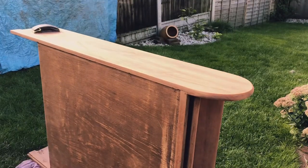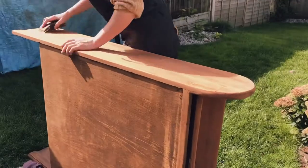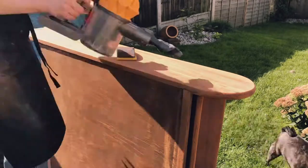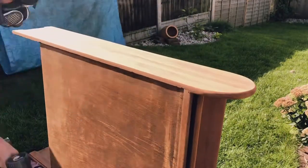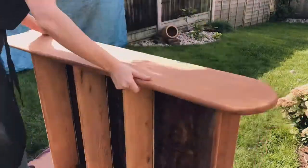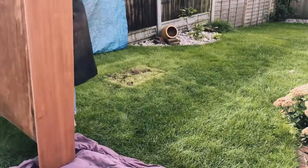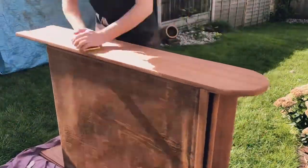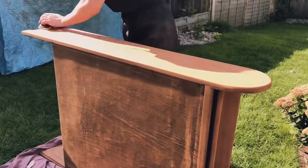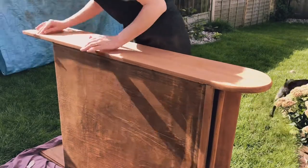I think there was also a stain underneath, so by the time you're seeing it, it's already had a chemical stripper on it which took hours and hours of scraping — really harsh chemicals, so I had to be super careful with the dogs and had to be all tugged up in my PPE. After that it's had quite an abrasive electric sander used on it, then a smaller mouse sander for the detail work, and now we're into the hand sanding.